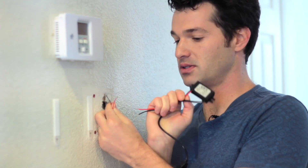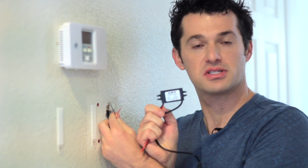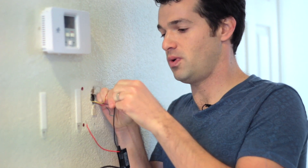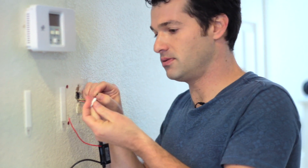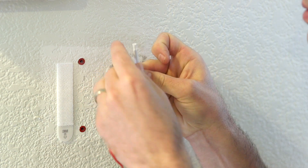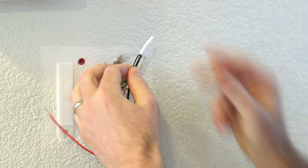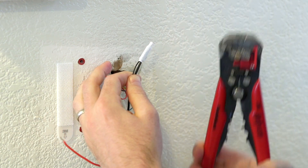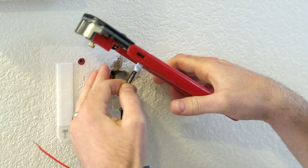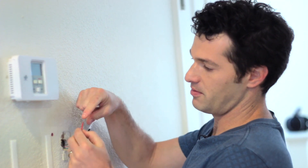This 12 volt to 5 volt USB adapter — all we have to do is splice onto the ends of these wires, and we simply match red to red and black to black. For this I like to use crimp connectors, also called B connectors. You just insert the two ends of the wires that you want to crimp together into the crimp connector, push them all the way in, and then use a wire crimper or just a pair of pliers to crimp the connector down and it'll make a tight connection. Crimp that a few times, and now we've got red to red.